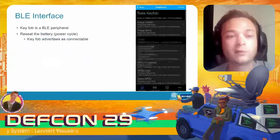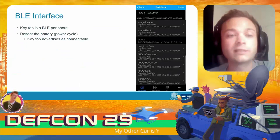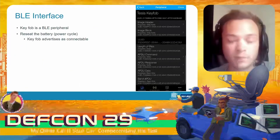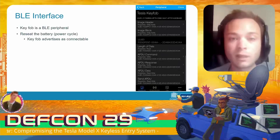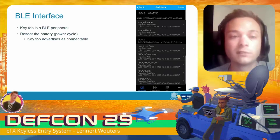If you take the battery out of this key fob and put it back in — basically power cycle it — it will start advertising itself as a connectable Bluetooth Low Energy peripheral. You can then connect to it with an app on your phone and see all of the services and characteristics exposed on the device.